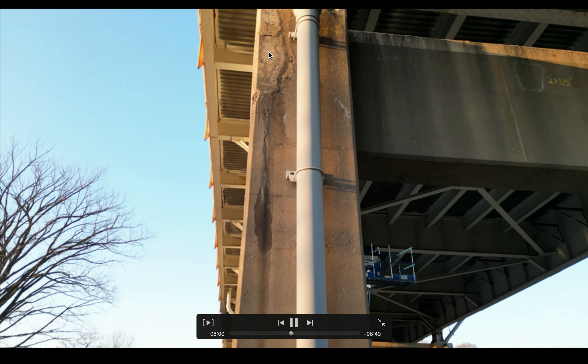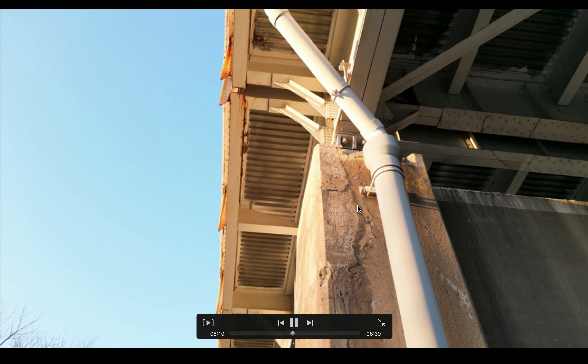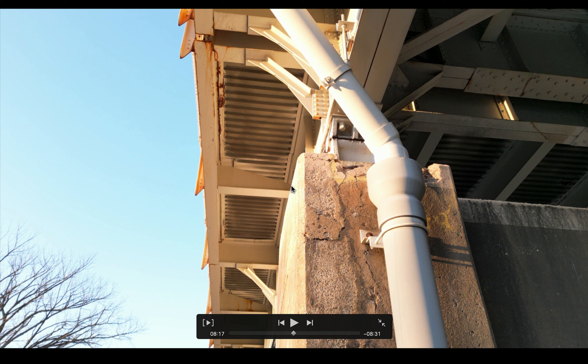Now we're back to this column. There's a repair here — that's the repair; it looks like junk. It's not really jacketing — not really a top-notch job. Here again, duplication: there's that steel. This is bridge decking — the B-decking. This is what I proposed for the Royal Towers; it would be the same thing, support it out there like this. I did think about bracing back to the wall, but it's just not worth it — the loads are too great, it might cause a rotation into the structure. It wasn't designed to take that torque rotation.